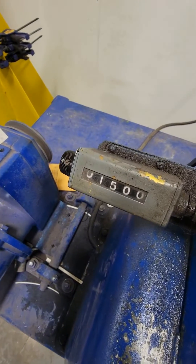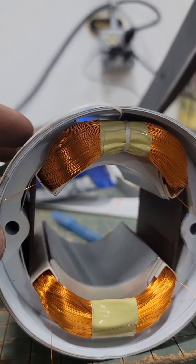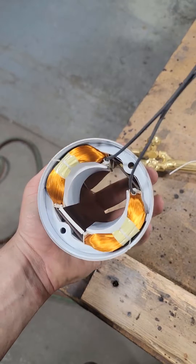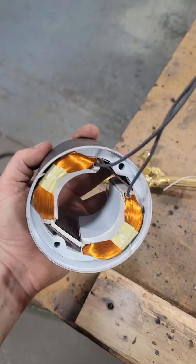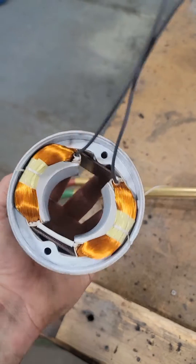You can see how the coil sits on this winding head, then I can collapse that winding head and remove the coil — there it is, our 1500 turns. I wanted these coils to lay a little tighter to the stack, but there's some spring action. On the top one I tied some string around it, ran it through the stator, tied it on the other side, and was able to tighten them down so our end bells will still be able to sit in and support our armature.